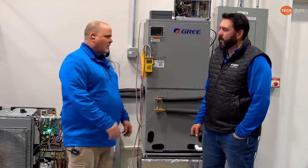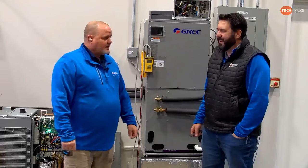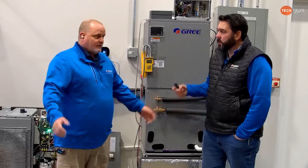I've taken the calls and gotten on the phone. Hey, have you walked through the house and made sure all the registers are open? No, I haven't done that. Well, let's do that, because we may be ready to condemn the ductwork over the wrong issue, and it's just a matter of fact that the registers aren't open. Do they have any dampers in the system? Do they have manual dampers in the system, which are sometimes hard to find? Sometimes they are hard to find.